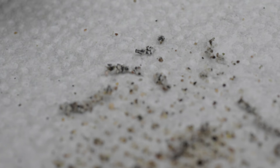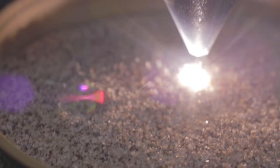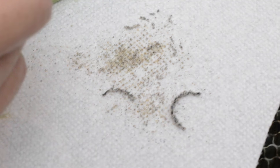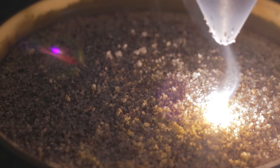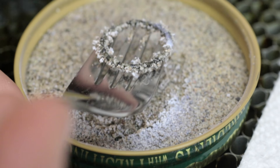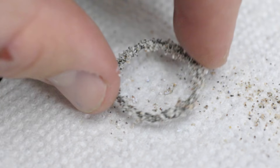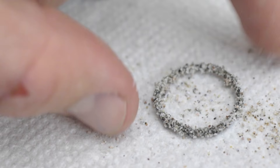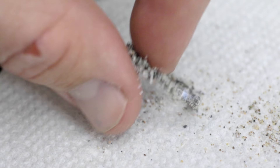This test kind of has just some scattered pieces. It partially worked, but this looks really frail. Laser sinter test number two — a little more solid ring, though it still kind of fell apart. This next test is going to be a lower speed and more out of focus. You can see it almost looks like welding where it's forming a bead and the pieces start melting and joining into the blob. This one holds together really well compared to the other ones — the fact that it's surviving on its own is pretty cool.